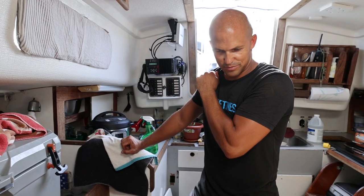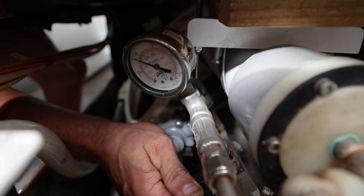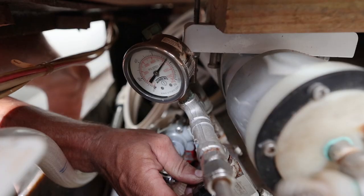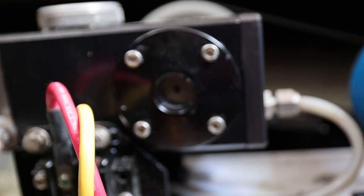Very true. Now we're gonna pressurize it and hope that it gets to 800 PSI. Before it was only getting to 600, so it wasn't enough to desalinate the water. And it was barely trickling out of the sample. Oh baby! Yay, my efforts weren't for nothing. That sounds so quiet compared to when we used to run it. Way better. And you know how to do it.